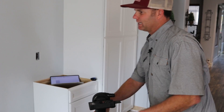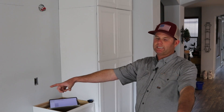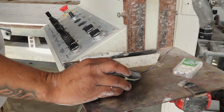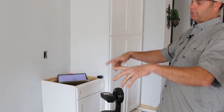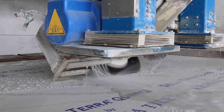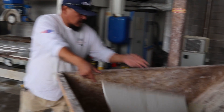You could do it in your sleep. The old way with the sticks is actually harder for us because Alvaro's saw is all computerized. If I bring him a stick template, he has no ability to get it into the computer — he has to manually cut everything on the saw. Whereas with this, I can create the DXF file, build the drawing in the CAD program, and send it to his saw. He has a digital template and can input it onto the saw, doing the paths and laying it out, then run the automated function and get it all cut out by itself.